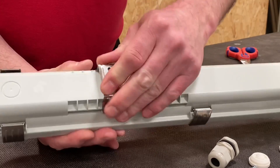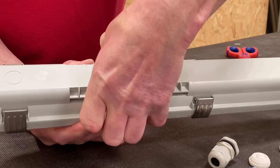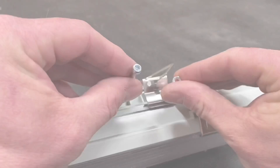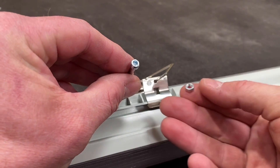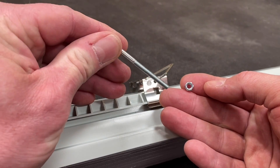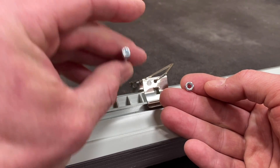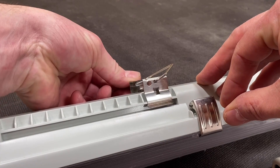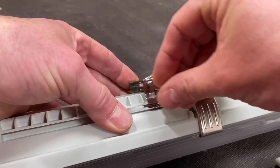You don't need to drill the fixture body at all to put your mounting brackets on, so you aren't worried about compromising your IP65 rating by drilling holes into it. If you want to add a security element — anti-theft or anti-vandal — there's a bolt that you can put through and it will grip against the actual fitting, so you can't then take the bracket off the back.